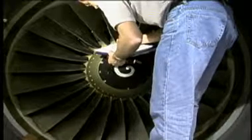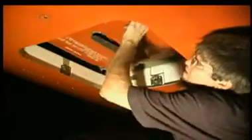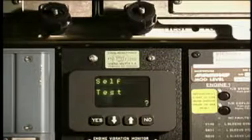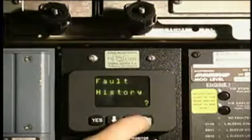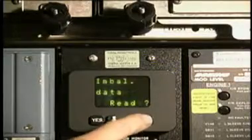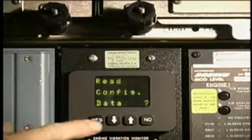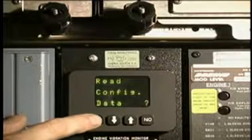Note that there are 36 balance screws and 24 fan blades on the engine. Next, go to the aircraft electronic equipment access door and access the airborne vibration monitor. Push and release one of the four buttons to display the self-test on the front panel display. Push and release the no button until you see the imbalanced data read screen. Push and release the no button — this causes the whole config screen to show. Push and release the yes button — this will cause the read config data screen to show. Push and release the yes button to display the balance screw locations in the airborne vibration monitor.